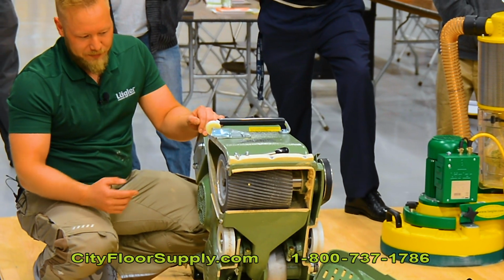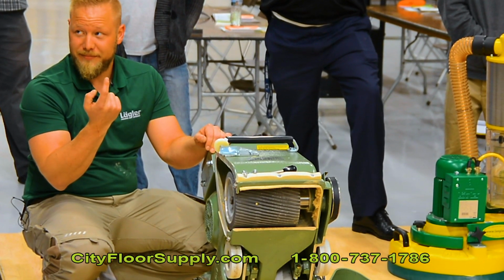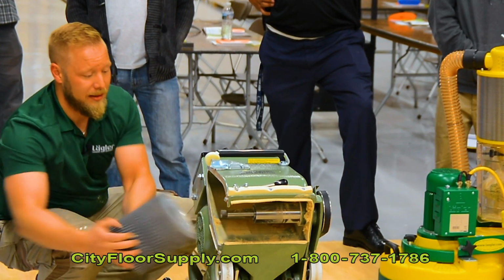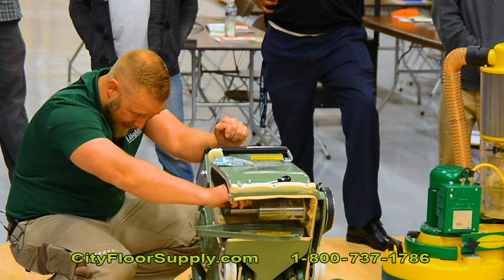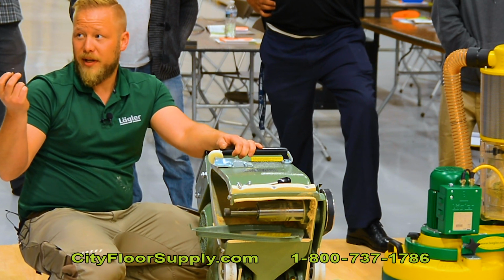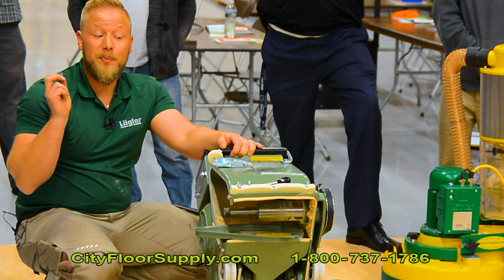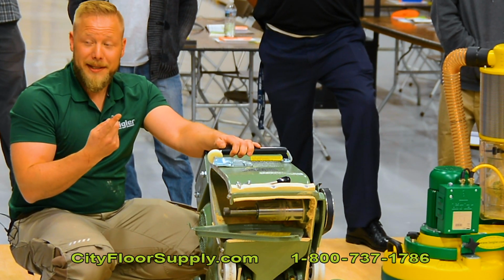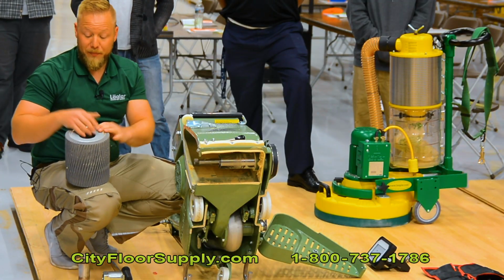Before you pull the drum, make sure that that slot right here faces upwards. All right, everybody sees that? Because if you don't, the key on the shaft will drop down into your fan unit and then you can go fishing for it. Do not try to turn on the machine and hope for it to come out the other end. Doesn't work.